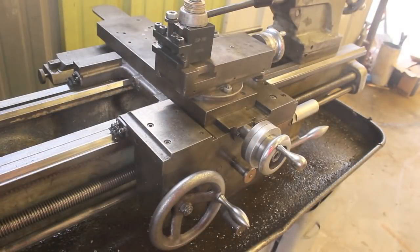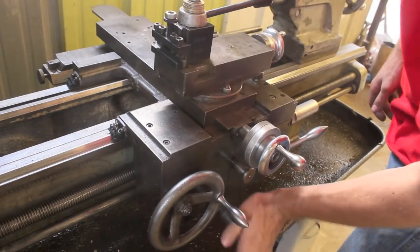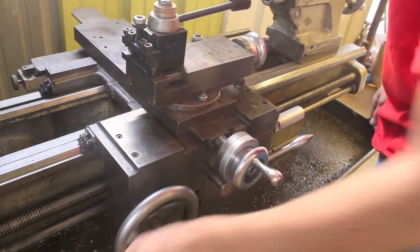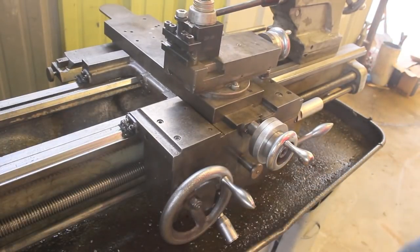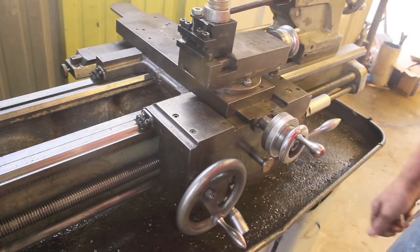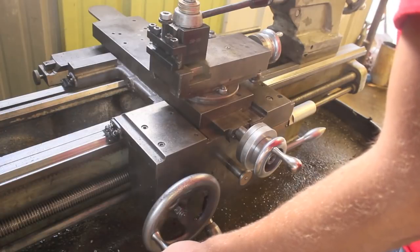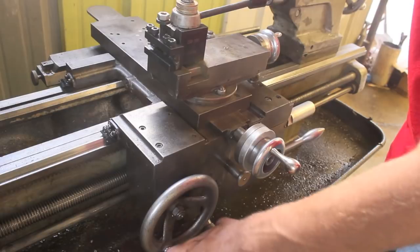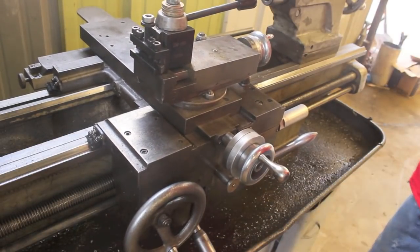But everything on it has a really nice feel to it. And you know, it feels very solid. Everything on here is made out of super heavy duty cast iron. And yeah, it's built like a tank. This lathe actually has a fairly small footprint. Footprint wise, it's actually barely any bigger than the Logan, but it weighs about 4 times as much, and it puts out 3 times the horsepower, and it's got a geared head and a quick change toolbox, gearbox rather. I'm really excited about that.